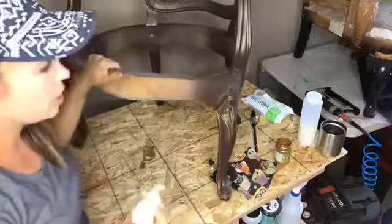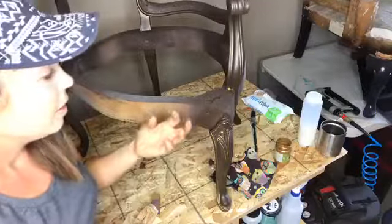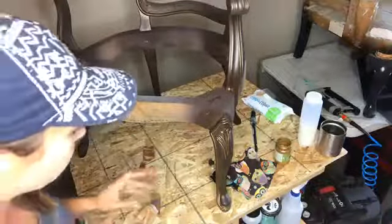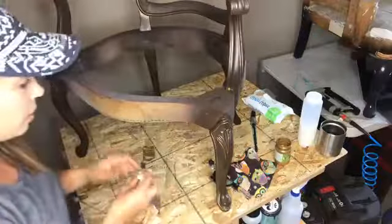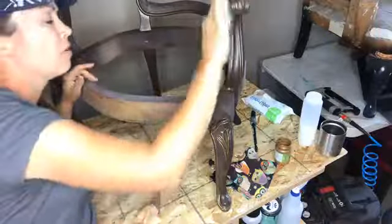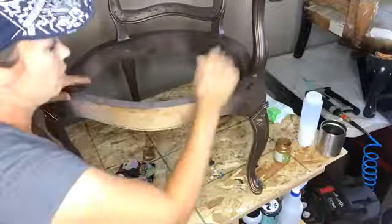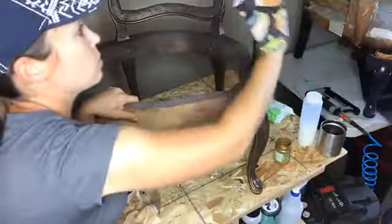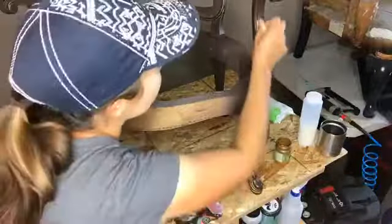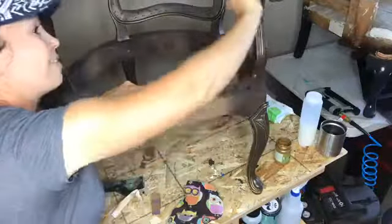Yeah, so chalk paint or chalk type paint is so porous, and that's why it has that really cool matte finish. Whatever you put on it, it pulls it in, so you really want to make sure you top coat first. And I like to let it dry about 24 hours before I glaze it. Since most top coats you use on chalk paint are water base, you don't want to be rubbing the top coat off because it hasn't cured yet.